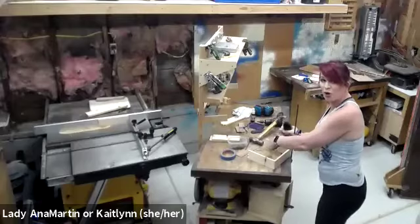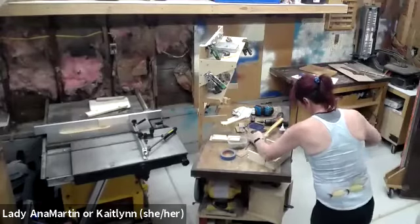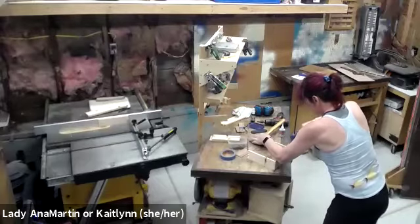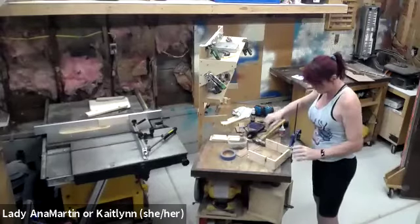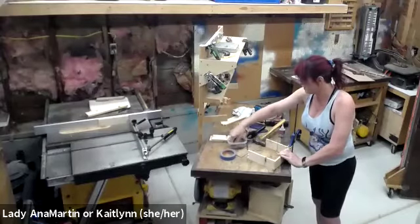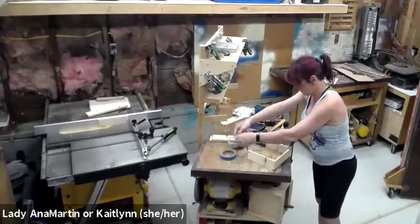This, by the way, is called a palm hammer. The best thing to use is a 10 or 15 pound free weight. You just hold it behind something when you've got a nail into it, and that way the shock is transferred into that and it doesn't just bounce all over the place on you.